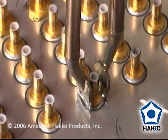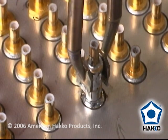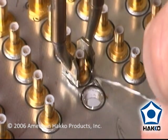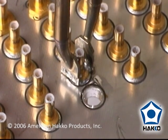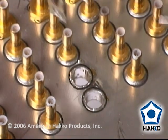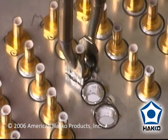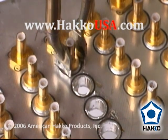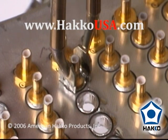Feed the solder onto either side. You can even just see the solder wet around that and then it lifts right out. But if I tried to do it without adding the solder, it would take a lot longer to reflow. And because we're removing it, adding that little bit of solder — even if it gives you a little extra cleanup to come back and remove the excess — that's a whole lot better.